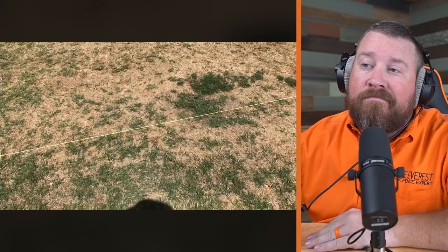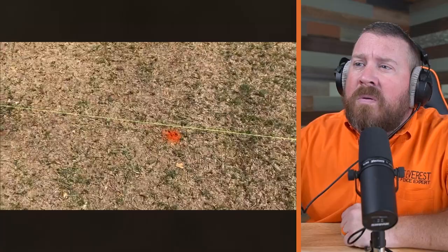So when you're dealing with chain link fence, the maximum length between either terminal post and line post or between two line posts is 10 foot or less. So in this one, it sounds like he's spacing them at 8 foot intervals. So the standard is 10 foot or less on line post spacing. After that, we're going to mark it with a high-vis paint. Every support post we have marked right here with the high-vis.